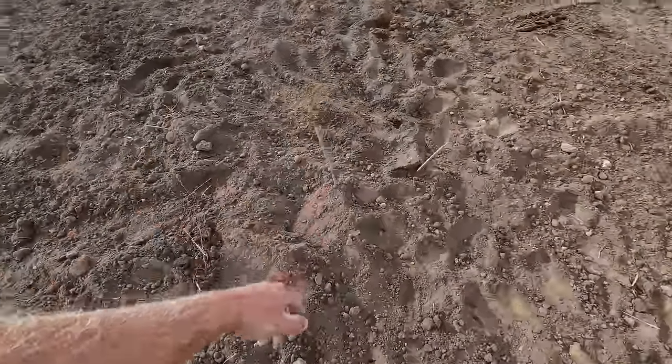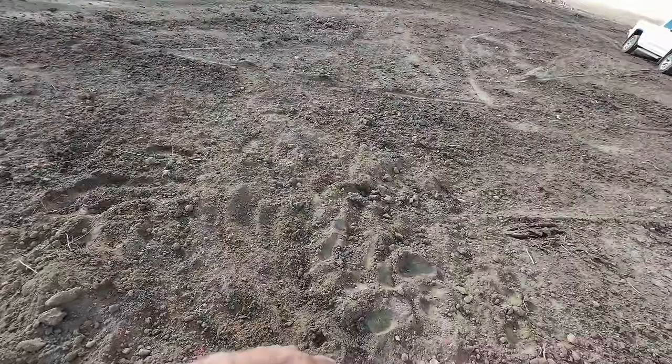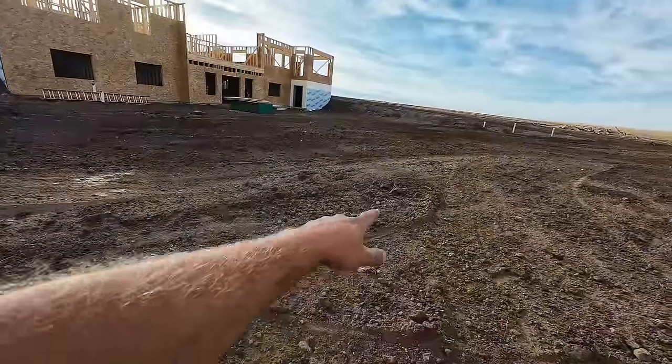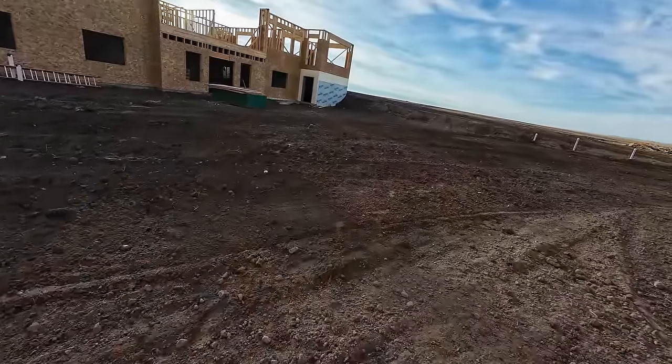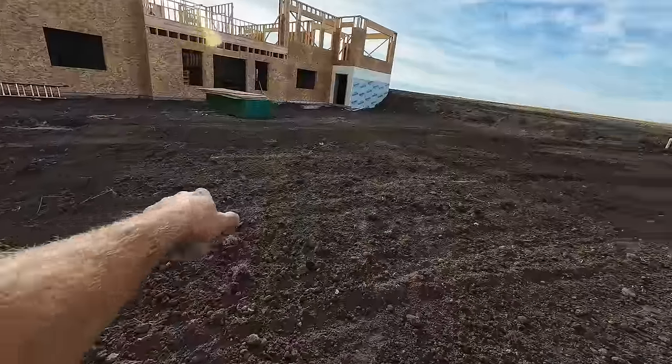Here's my riser box, the concrete, or I shouldn't say riser box, the diffuser box. It's that concrete diffuser, that distributor, you want to call it, that sets the runs. And then I did a little more grade work here. I can see I got to bring a little more topsoil on this end. I guess got kind of a low spot just from checking with my visual eye, but I'll get the laser grade out here and confirming there's a high spot right here.